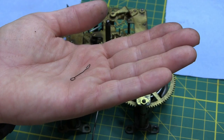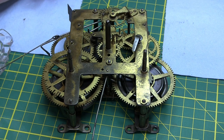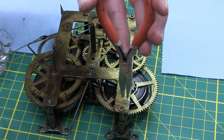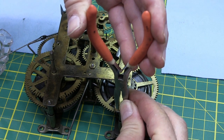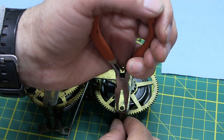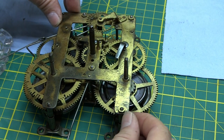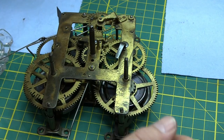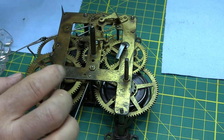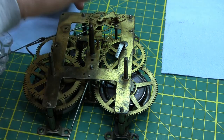I'll just go around and take these nuts off. When you put the pliers on, I don't go all the way down — I leave it up a little bit so it's not contacting the plate; that way when I turn it, it's not going to scratch. So I bottom out all the way down, pull up just a little bit, then turn. This thing is so dirty that my fingerprints aren't going to do anything except get my fingers dirty. There's one more pillar nut here. So there were five pillar posts: one, two, three, four, five.